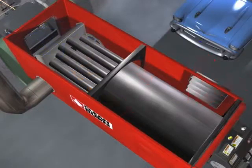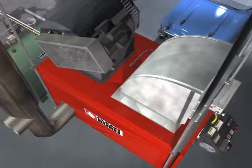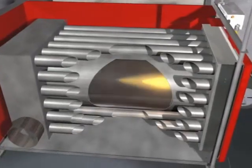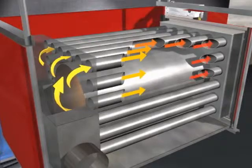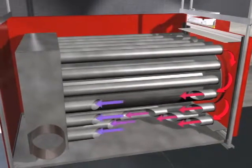Clean Burn is able to take heat extraction to yet another level inside its larger furnaces. It employs an advanced multi-pass approach in extracting heat from the gases produced by the burner, and another multi-pass method in transferring that heat to your shop environment. Once again, combustion takes place in a large blast chamber with an energy retention plate at the opposite end. As the hot gases arrive at the rear of the furnace, they are routed through the top tube array back towards the front of the furnace, then take another turn and move toward the back through the bottom tube array.